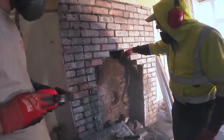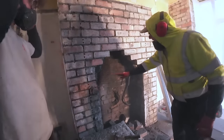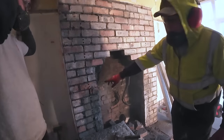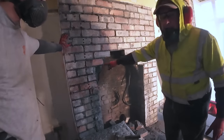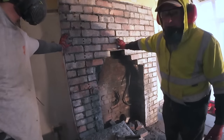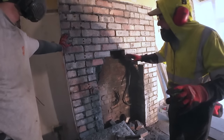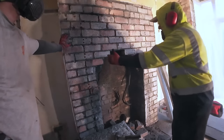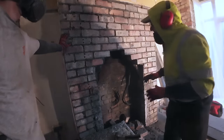Perfect demonstration of how propping in brickwork works. So you put a prop here, when it all falls as far as it goes, it naturally stops like that, so that's supporting itself. That's why I don't need millions of ACROWS all lined up dead close to each other. So there you go. So now we have to start taking these out, let's go back, further back.